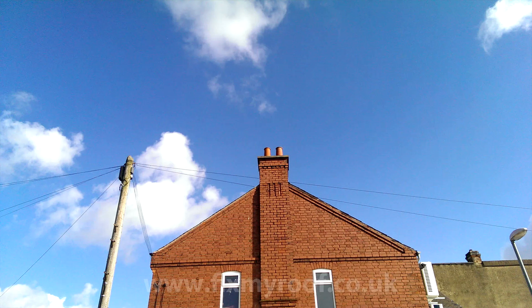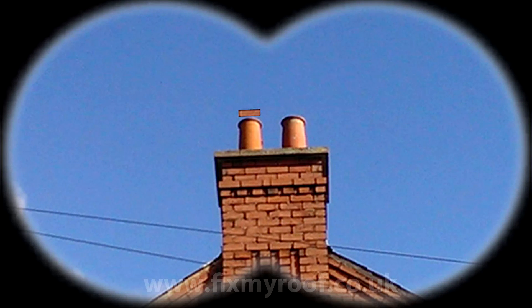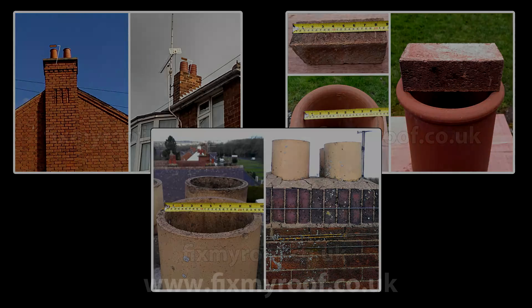Here we have a two pot stack as viewed from ground level. Now I've zoomed in a bit closer. Let's choose a full brick near the top near the pot — say this one. Just by imagining it above the top of the pot you can repeat the process we did earlier. I have literally copied the brick and pasted it just above the chimney pot, and you can see how it would work out almost exactly like our earlier example. Using this technique it should be easy to get measurements for chimney cowls and caps. If you want more real life examples of pots and how to measure them, visit the website link at the end of the video or in the description bar.